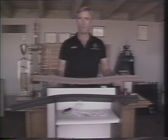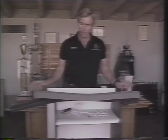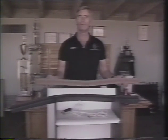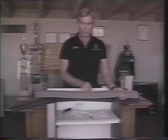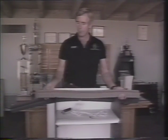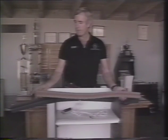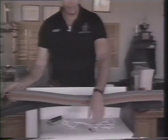I'm now going to demonstrate the other 2 types of explosive flexible linear cutting charges that we manufacture. We have the Model 520 and the Model 521. The difference being the Model 520 consists of a 3.5-foot length of soft flexible foam in which we've installed 3 cords loaded with high explosive. It has a total explosive weight of 300 grains per foot. It comes with the sticky tape on the front of the strip and the 2 end cords where the blasting cap would be attached.